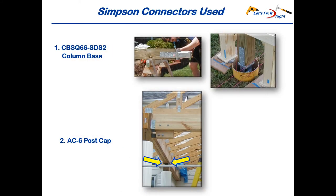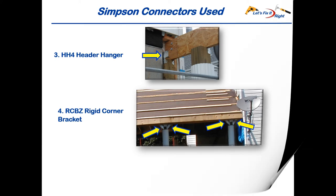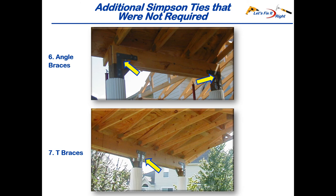The five types of Simpson connectors that I used are shown as follows. This is the Simpson column base that I bolted to all of my columns and submerged within the top sections of my eight concrete piers. And these are the Simpson post caps that connected the tops of my columns to the beams. This is the Simpson header hanger that I used to connect the right patio beam to the four-by-six column that I embedded in the back wall of my kitchen. These are the rigid corner brackets that I used to reinforce the attachments of all the columns to their beams. As an option, I added these Simpson angle and T braces that I had to special order. When the building inspector saw these, he commented that my structure was overbuilt and the patio was more likely to withstand a tornado while our house perished.